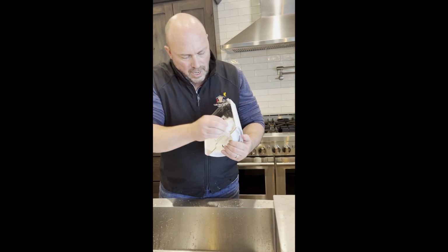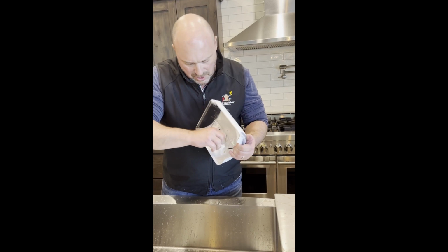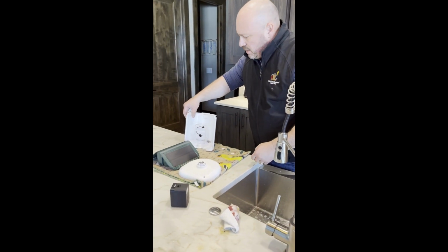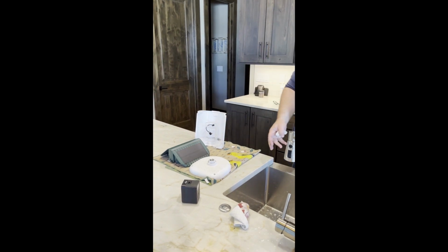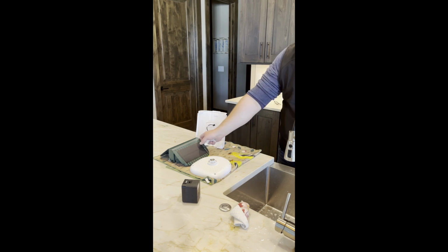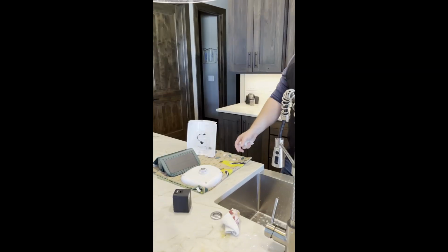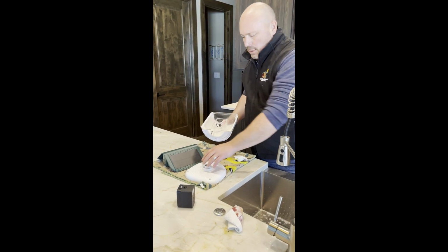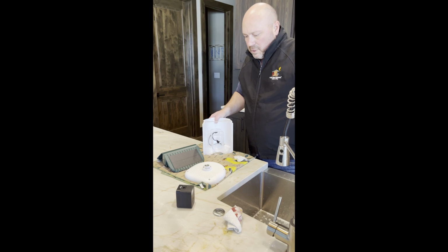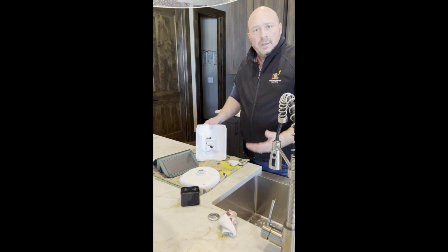And then after it's all dry, you can do one more run on the front of the hopper if you want, just to make sure that it's completely clean. That's it. Then we're going to set it up and just let these components dry, probably overnight. That will make sure that if there's any water in the cables or the connector here, that will dry out before you reconnect it. And then it's just reassemble it by putting the base back on with the thumb screw, putting the roof back on, and plugging the cable together, and then putting the camera back in the housing and connecting the cable. And there you have it.